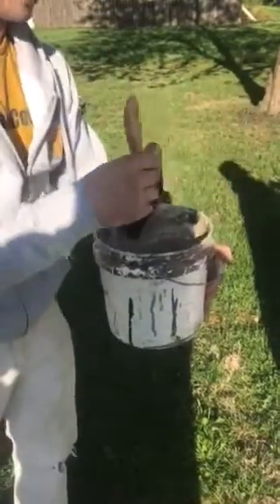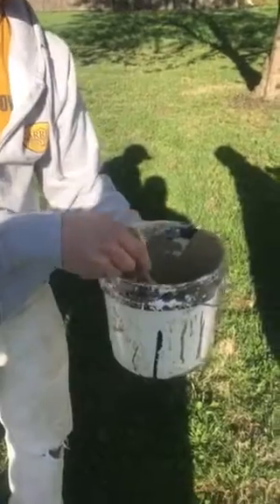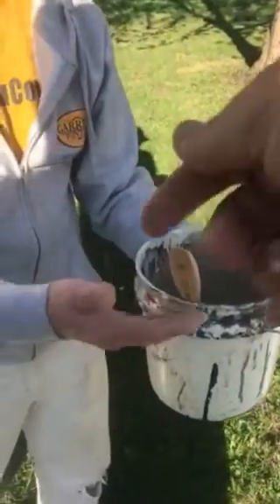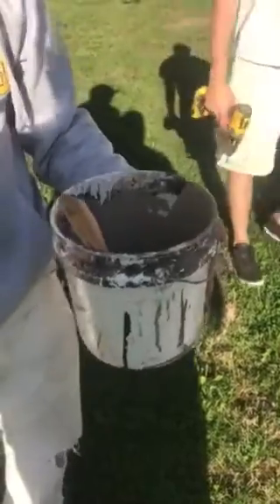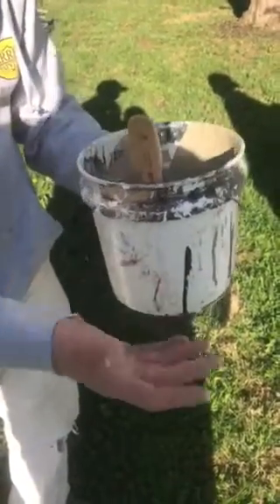If you're raking your brush, try to do it in one spot continually. That way, when you put your brush down, you can lay it over like that and you have a clean side. This will prevent you from getting paint all over your handle and all over your hands. Once it gets on your hands, you're transferring it everywhere else on the job site.